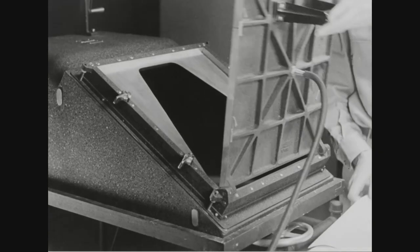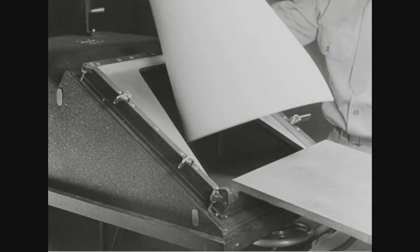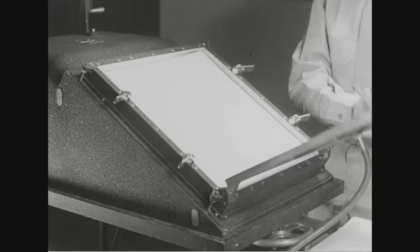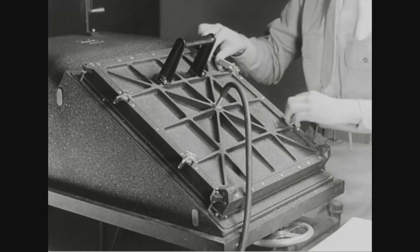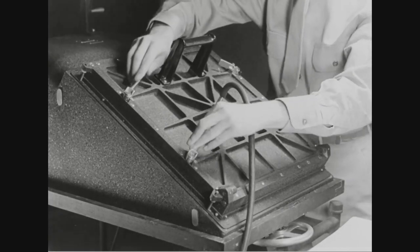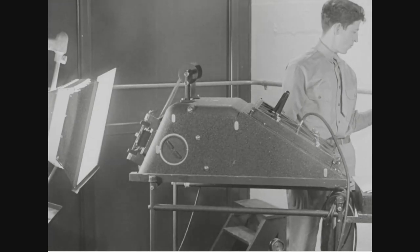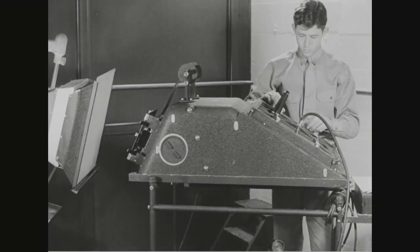In printing negatives from the T3A camera, the B7 printer is used for the oblique photographs. The necessary correction in scale is made by projection printing, and the prints developed in the same manner as the contact prints.